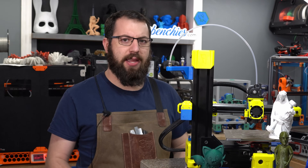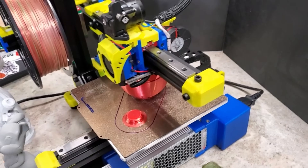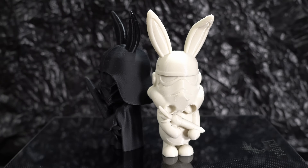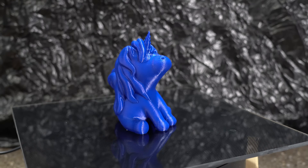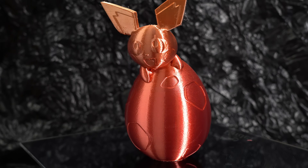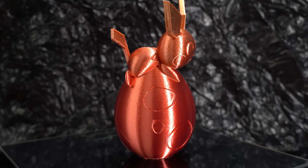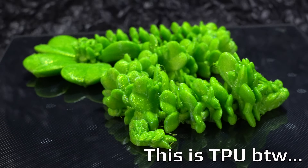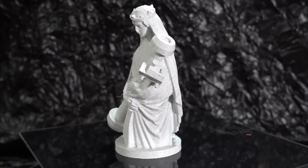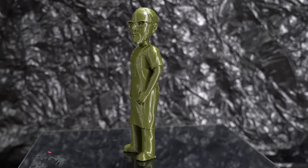That's just kind of a personal nitpick, and it's really the only takeaway I have of the build — there are a lot of little random parts on a relatively small printer. I guess if you're nitpicking that, there's really not much else to complain about. I've had the machine up and running now for several weeks and put some print hours on it. The answer to how well it prints is: pretty well. For all these prints, I ran the stock SuperSlicer profile that RatRig has put out for this machine and haven't done too much tweaking. Kudos to the EVA tool head — it provides excellent part cooling with the 5015 fans and the ducts.